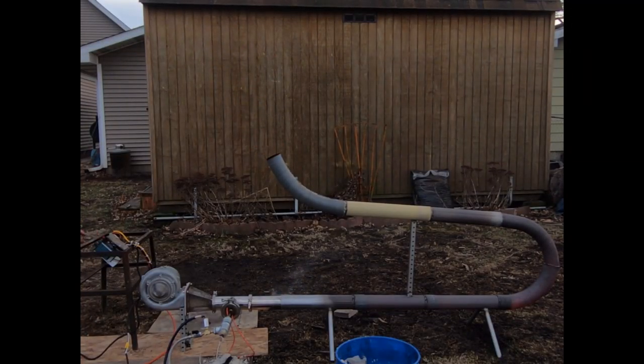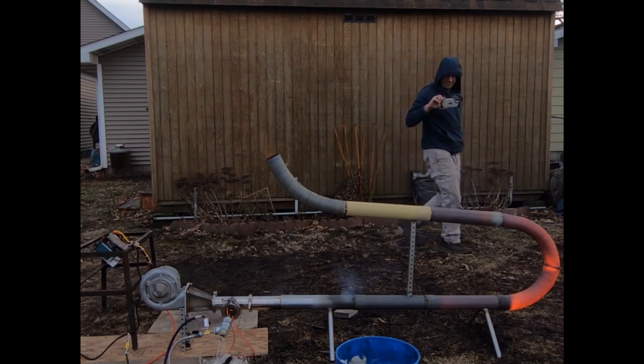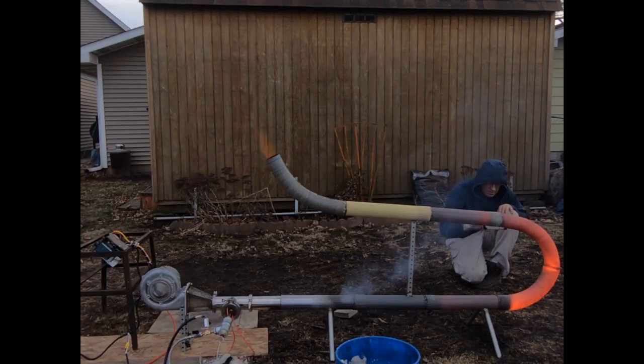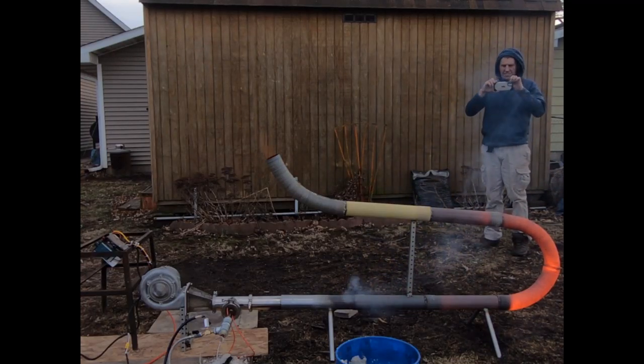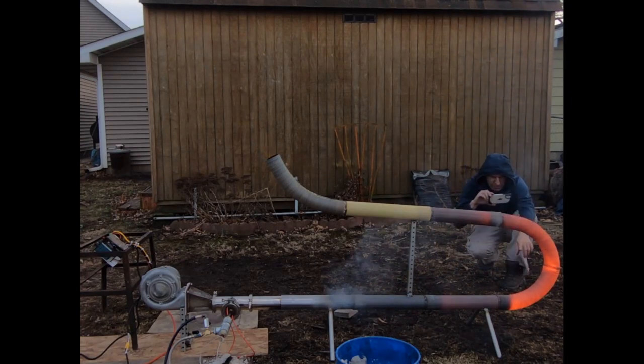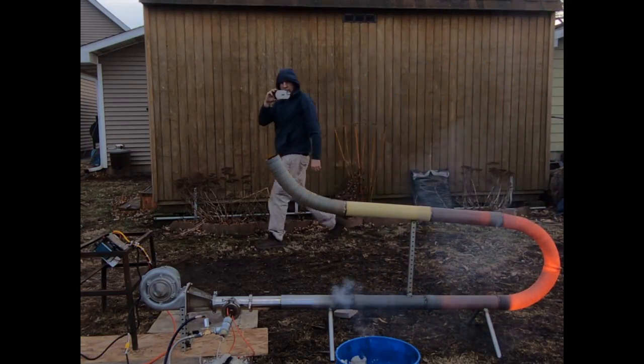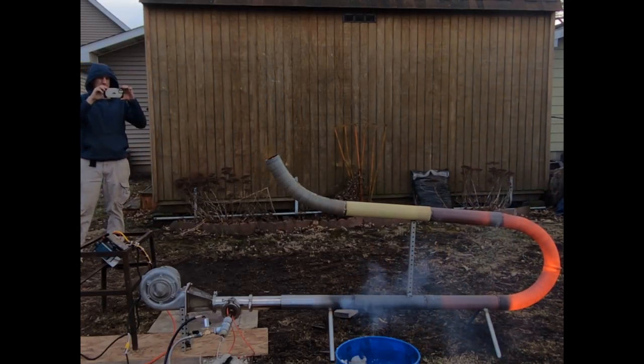Alright Steve-o, so this is all you, man — I think we got this in the bag. The size of the tubes that you guys have looked like eight inches or more, maybe. The picture is kind of... I'm just going off the size of the brick in your foundry. Not sure the exact diameter, but the bigger the diameter, the better this thing is going to work. We are experiencing some extremely high velocities in this very small tube — this is not an ideal setup at all. But nonetheless, the fact we were able to do this in a three-inch diameter pipe tells me we're not going to have any problems at all doing it in a larger pipe, because the flow velocities will be a little bit lower, and the flame front velocity of the fuel we're burning is very slow. So that's kind of important — you don't want to just blow the flame out of the tube. That's kind of one of the situations we've got to deal with.